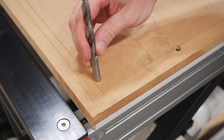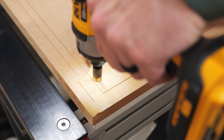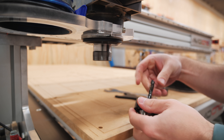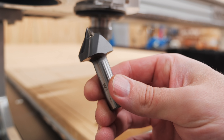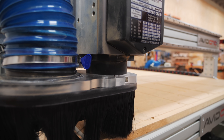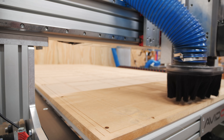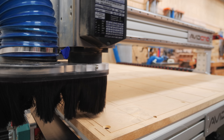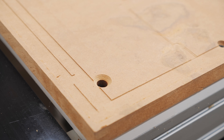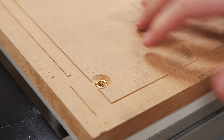Once the program finished, I confirmed the hole size with the drill bit included in the quarter-twenty threaded insert kit from Rockler, and the insert fit great. But next I needed to recess it below the surface of the spoilboard so I can continue surfacing it in the future without hitting the inserts. To recess the holes, I chamfered them using a 90 degree V-bit. I had initially set up this program using the new chamfering toolpath option in Aspire, but couldn't get it to cut more than a tiny chamfer, so I modified the initial hole drilling toolpath to cut to a shallower depth and ran the program again, leaving me with perfectly chamfered holes. You can see how the chamfer allows the insert to be driven much deeper into the spoilboard, giving me plenty of room for future surfacing.